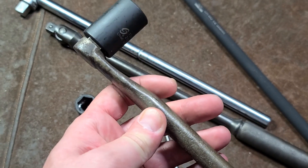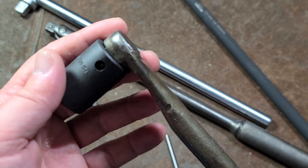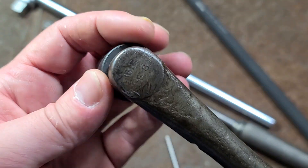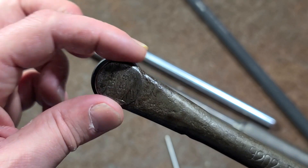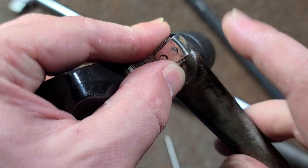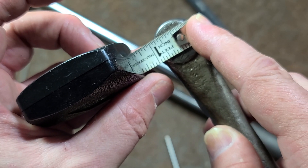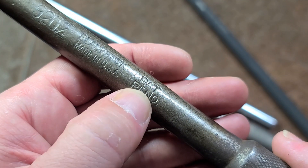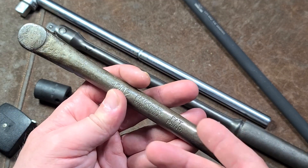There's just only space for essentially quarter-inch and three-eighths drive tools. This is what makes these such a huge advantage in certain edge cases — you just need a strong breaker bar that fits in an absolutely tiny space, and that's exactly what this does. You can see the head is so small. A 19-millimeter socket is significantly larger than the head. The head itself is only about half-inch to five-eighths inch across. Let me take a look — maybe seven-eighths of an inch, but still super tiny. I wanted to point out that at least back then, this was actually a patent-pending wrench. Surprisingly enough, they came out with such a simple design that nobody else had anything similar, at least back when this was made.